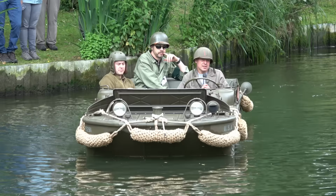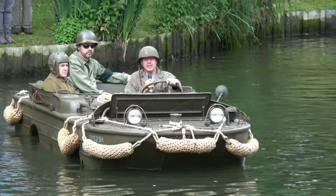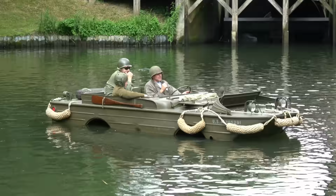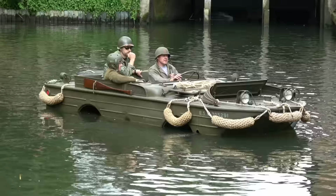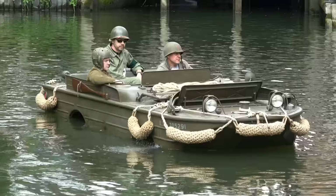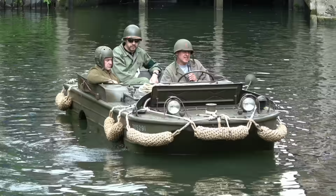They designed them so that if you got in rough water, you could do a couple of things. There's a spray deck, which at the moment is folded back, and it's just by the windscreen, but you can fold that forward, same as on a duck, and that then gives you an extra 6 or 8 inches at the front of it. That operates some baffles in the side of the bow, and when that's closed, it's taking air from where our feet are, it goes forward into the bow, then back through the radiator. The other would open here, and that would then be the air exhaust. So you've got two ways of putting air through the engine and the radiator, each in opposite directions, and you just choose which one's appropriate for the sea conditions that you're in at the time.